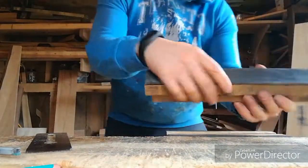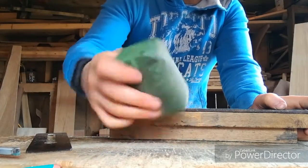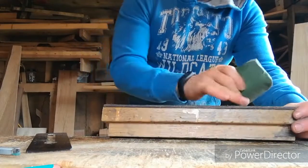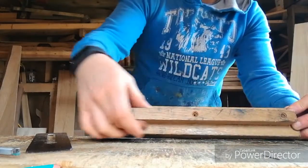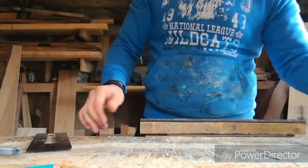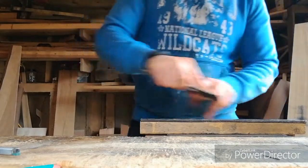I'm going to finish with the leather strop on my bench. This is a leather strop with some buffing compound — I think it was about five pounds from eBay, a big chunk of it, and I've had it about two years. It's really cheap. You apply this to the leather strop. It's just a piece of leather that I've epoxied onto some oak. This section here goes into the vise to fix it in place. When I'm stropping, I like to put it at 25 degrees and lift one edge ever so slightly, then go about 30 to 40 times. Then the same on the other side.